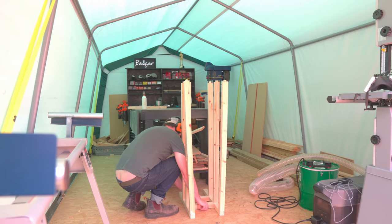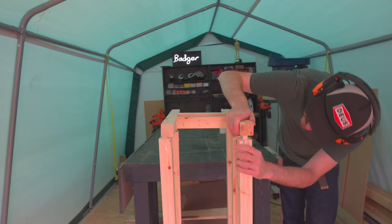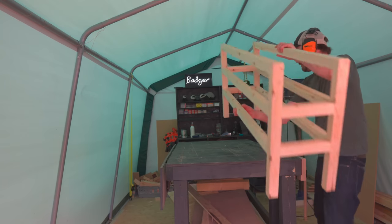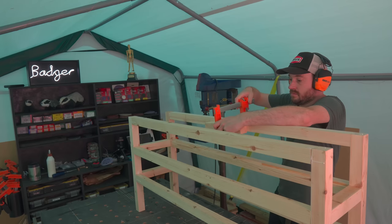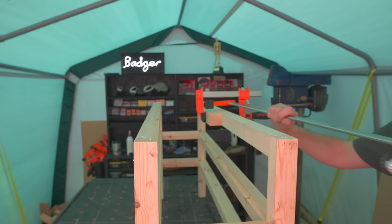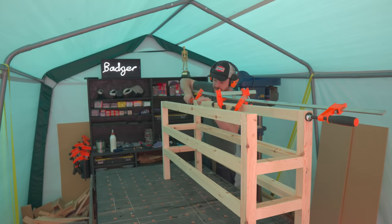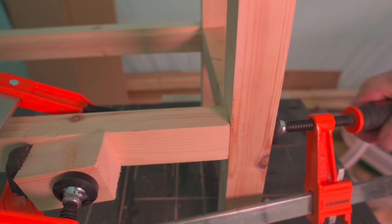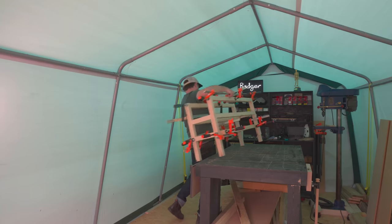People always advise having a dry assembly before glue-up. I didn't listen, so I ran out of ceiling space halfway through and had to move the whole thing down onto the floor. But I managed to get it all put together before the glue went off, and then I can get it back onto the bench to get some clamps on. This thing is 122cm long and I don't have any clamps long enough, so I'm just clamping some blocks of wood on halfway along it. I can then hook the longest clamps I have over that block onto the end and pull everything tight, from either end and each side. The old adage is true — you can never have enough clamps, and I didn't.